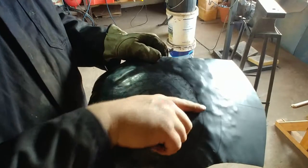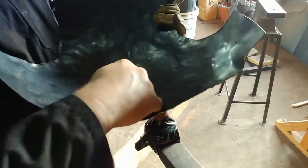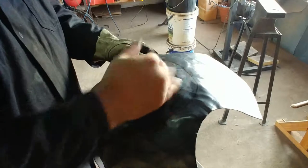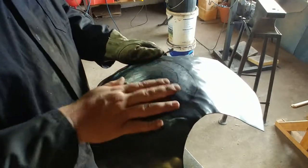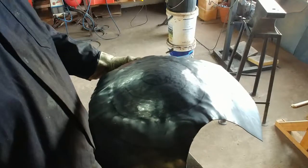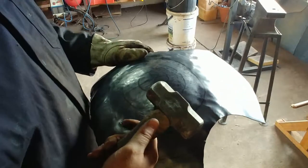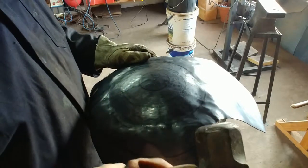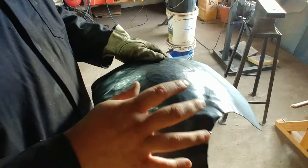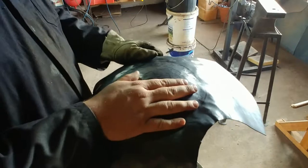When doing a cut like this, it's best to divide it up into circles and alternate — go one way, then the opposite way. Otherwise you're just moving steel around: with dishing from one side you're spreading it, smoothing it over and moving the steel. If you keep going one direction the whole time you're going to start warping the steel quite a bit, so always alternate. I use this hammer — it's heavy but it moves the steel easily.